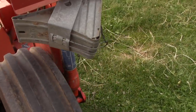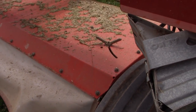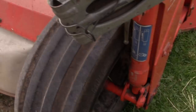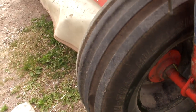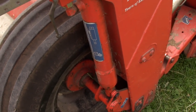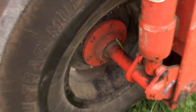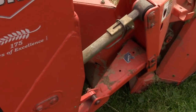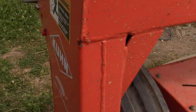The other problem we're having is this tire is hitting the frame — you can see it. Doesn't seem like the bearing is bad, doesn't really seem like the frame is bent or anything like that, just wearing the paint off. You can see it around there. I'm not sure — I guess you could put a little spacer plate on the other side of that hub and push it out, or maybe there's an adjustment. It's right against the frame pretty much — this brace plate there hits it.